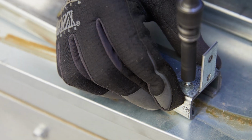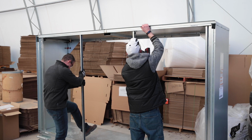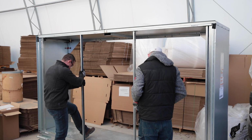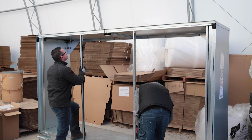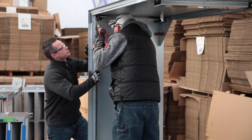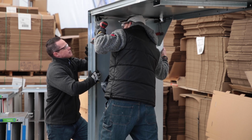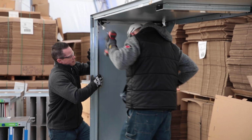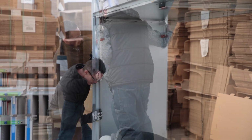Attach the mounting brackets to the top and bottom of each post and slide them into position on the marks previously made. Attach the brackets to the floor and ceiling of the air handler using number 10 screws. Cut the provided aluminum side filler angles to fit between the floor and ceiling of the air handler and attach to the walls of the air handler. This will provide a uniform surface to attach the blank-off flashing.